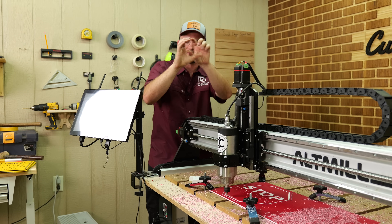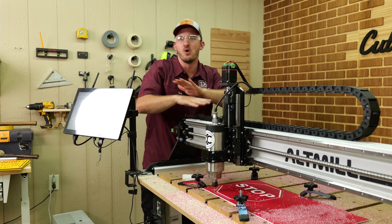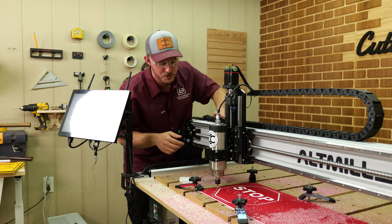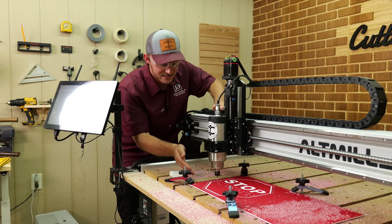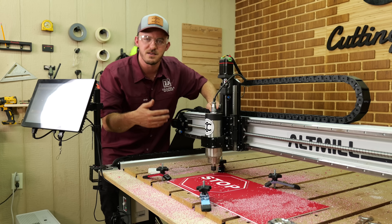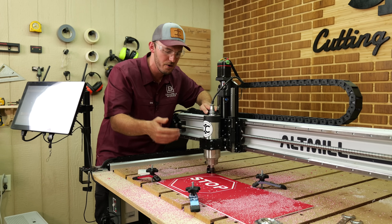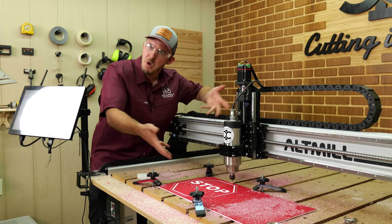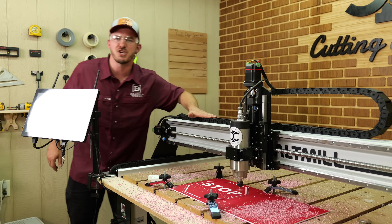Because you have that C-shape, it can drill holes really nice — it's that upcut ejecting all of those chips. I love this stuff. It's a very underutilized material and an underutilized bit, and I'm really excited to start carrying all this stuff and help you guys machine it.